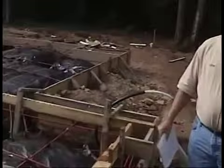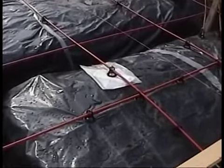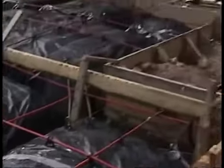One of the initial things we look for in a construction site is a copy of the plans. These plans are essential. And unfortunately, only about 1 of 10 new home sites that I check have a copy of the plans on site. What as an inspector you want to do is get those plans out and read how many tendons you're going to have, the depth, and other specifics. This is where the engineer and architect put in how this place is to be designed. And part of our job is to enforce the engineer and architect's desires as to how this house should be built.